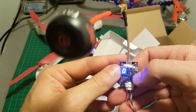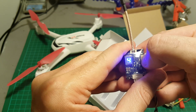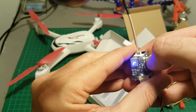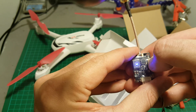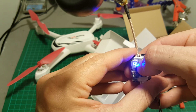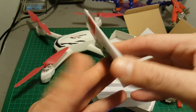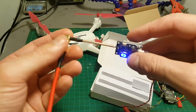I'm going to use my two-cell battery. The power starts at zero. Pressing it shortly selects the channel. If you long-press it again, it will let you choose the frequency — you have five to choose from. Long-pressing it again lets you choose between zero, one hyphen, two hyphens, and three hyphens, corresponding to 0, 25, 200, and 600 mW respectively. In the included manual they show you the frequency table, which is pretty useful — you should put it aside for reference.